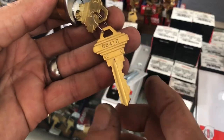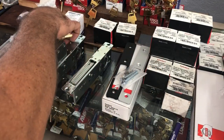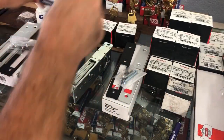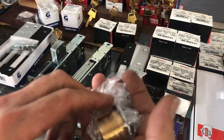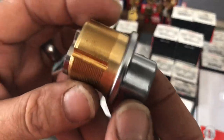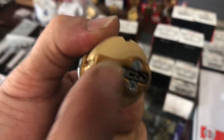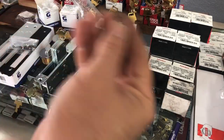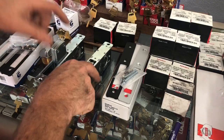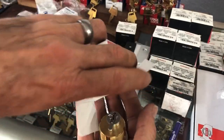You can use six pins in an inch and an eighth cylinder, but for most narrow style applications using five-pin keys, one inch is what you're looking for. The General Lock sends a one-inch thumb turn in the bag. Most inch and an eighth cylinders come with a standard cam installed, and they send the Adams Rite cam separately — so you can build up your collection of cams pretty easily just by buying a few of these.